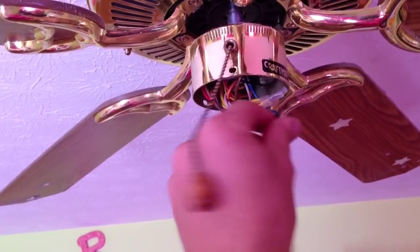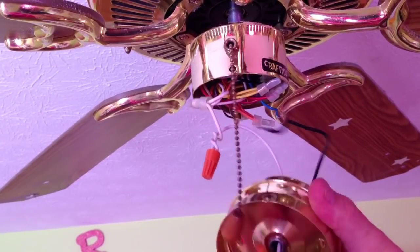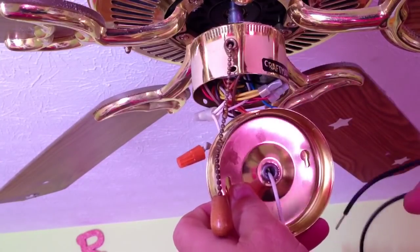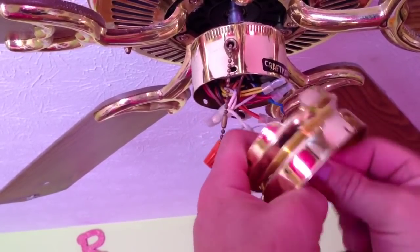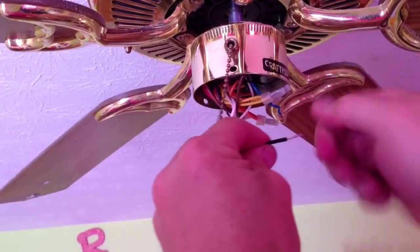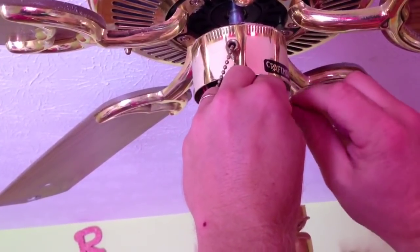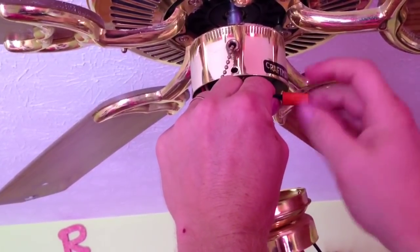Then I'm going to pull the wire down through — this is important, you have to pull the wire down through the light kit. And then when you get the new switch, you also have to feed the wire up through the light kit. My new light switch has two leads and they're both black. It really doesn't matter which place they go — as long as they have a good connection, it won't matter. So I'm going to feed that up through the hole in my light kit, make sure the wires are nice and tight and twisted, and then simply put it together with the wire in the ceiling fan — the one that I just took off with the wire nut. I'm going to go ahead and reuse that wire nut; there's no reason not to. I'll twist my wires together and then reuse that wire nut and tighten it back on there.